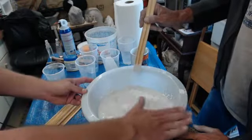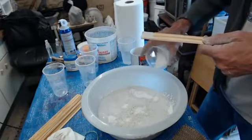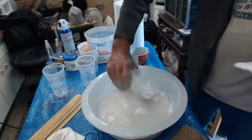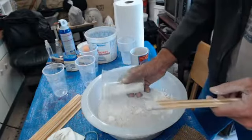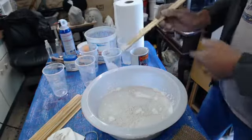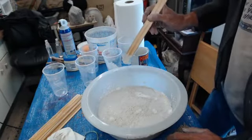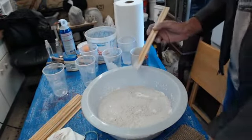We don't want to mix in the dry material, because then you get all these wicked clumps and it's very hard to get a smooth, creamy batter-like consistency when we're putting that on the sculpt. And this is where the rubber meets the road, because if your mold at this point, your beauty coat, detail coat, if that is not a good coat, if it's too thick, if it's too thin, you could have all sorts of issues with your cast piece. So it really is a bit of science. You have to make sure that you get it done right.